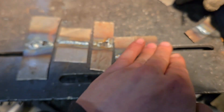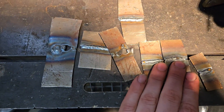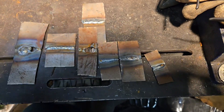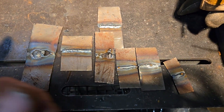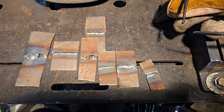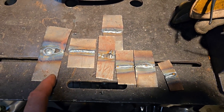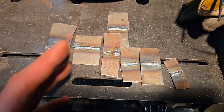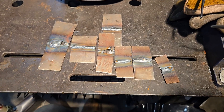The last tip is to practice on a piece that isn't important. I had to practice quite a few welds to get the settings right before reaching what I'd call optimal settings. Don't be afraid to practice on scrap pieces. Your first weld to find the right settings should never be on the actual finish piece — find a scrap piece or buy extra material at the same thickness and figure out the settings first.